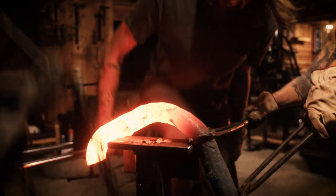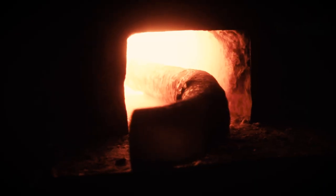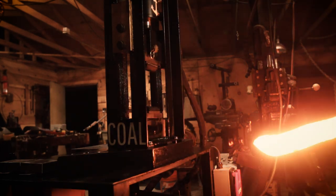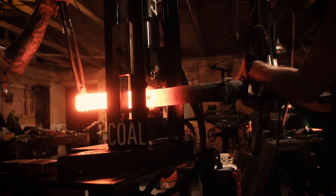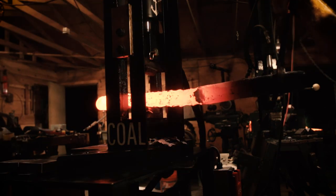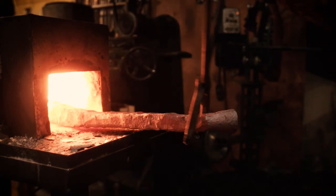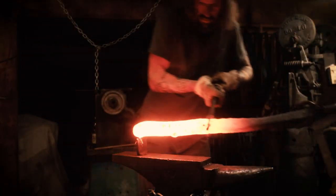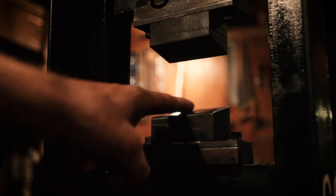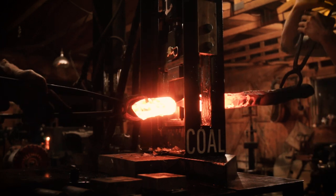Using Ryan's larger forge and his homemade treadle hammer, we were finally able to get the link straightened out to fit inside the forge. Finally, I could start using the 12-ton to draw the material out. We realized pretty quickly that we were going to max out the forge's capacity, so we made some indexing marks using a hot cut and switched out the draw dies on the press and replaced them with the butchers — nothing like chopping through all that steel in one heat.